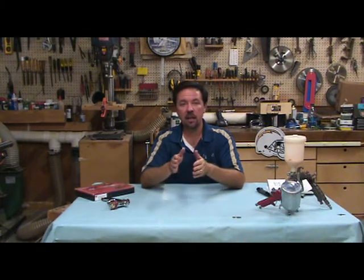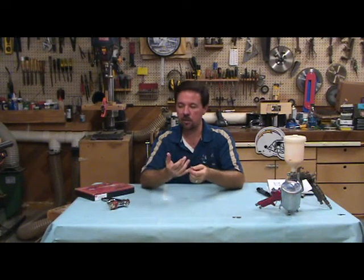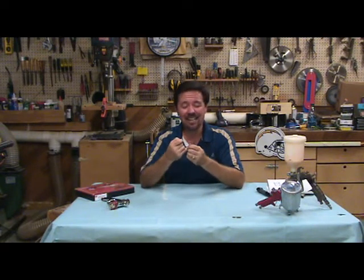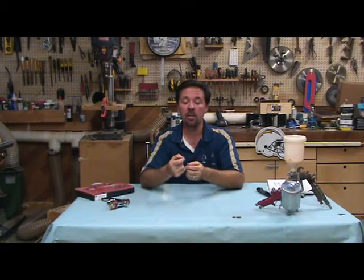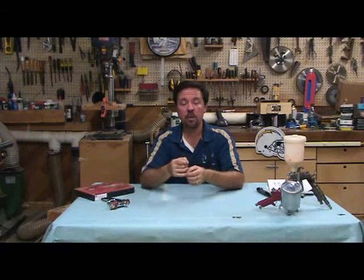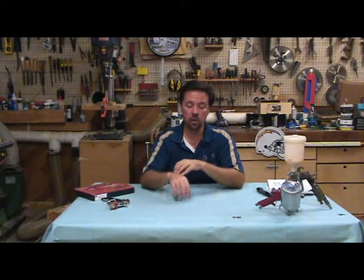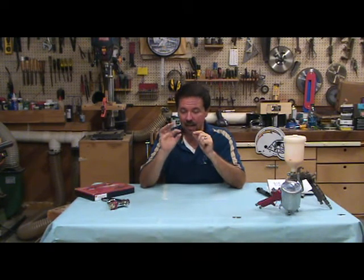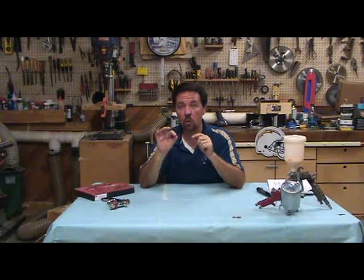And airless, there's a couple different manufacturers of those out there. Graco, Titan 440 is another one I'm going to drop a name on. I really like that one. Small, compact, incredibly efficient and reliable. Double orifice tip. Anytime you're spraying your finish, use a double orifice tip. You've got a pre-orifice behind the actual spray pattern that breaks it up twice. It is a definite difference on it.